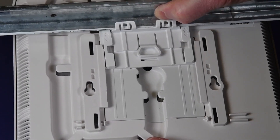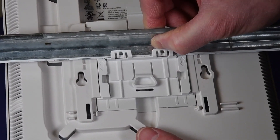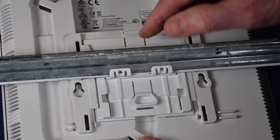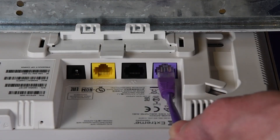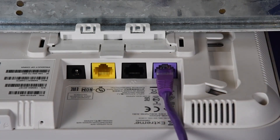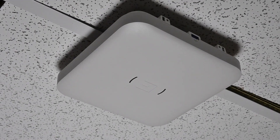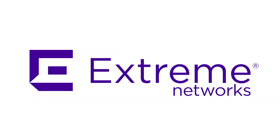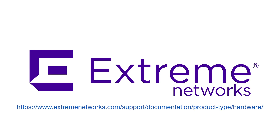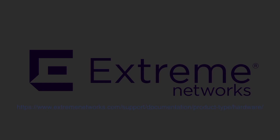Slide the DC flush bracket base into the back of the access point. The locking tab fits into a groove outside the access point. Attach the RJ45 cable and place the ceiling tile back in place. You have now successfully installed the AP500 series access point on a non-protruded ceiling. For more installation options, visit the Extreme Networks documentation site and refer to the AP500 series installation guides, or visit www.extremenetworks.com.